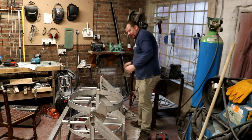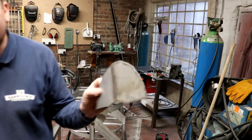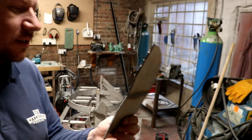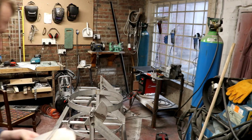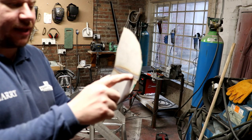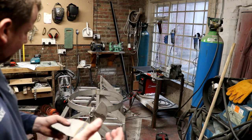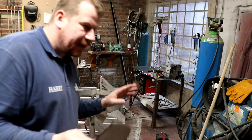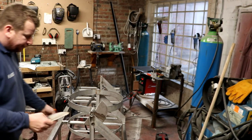So when I made all the brewery tanks, I had lots of scrap steel, like little offcuts like this. And this was some 3mm stuff, which I think is the only stuff that's thick enough to act as these half moon retaining cams, if you like. But I had to weld two pieces together, and then cut it with a plasma cutter, and it's not come out the shape that I want it to be. So there's kind of pieces missing, and I'm really not that happy with it, to be honest, but it functions.